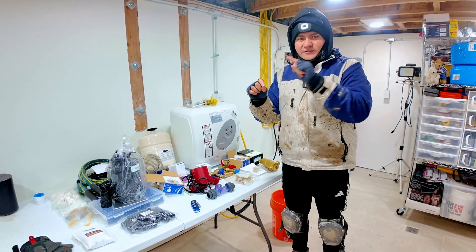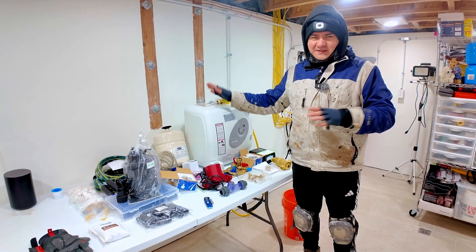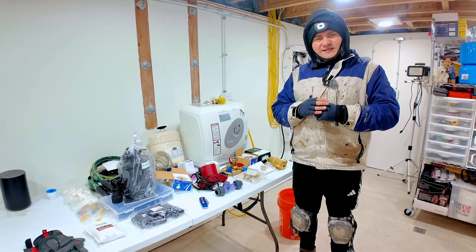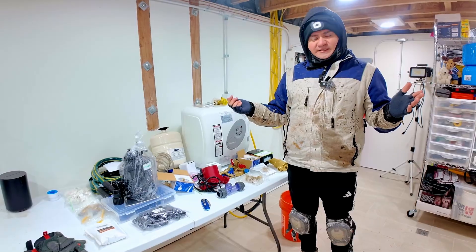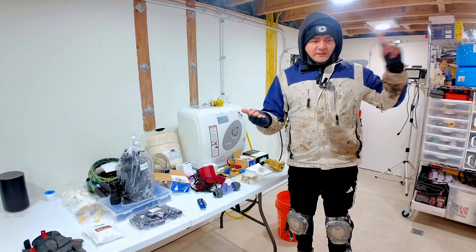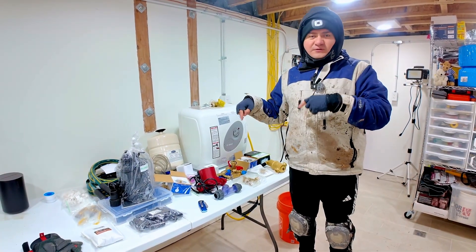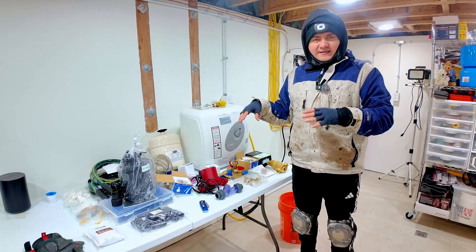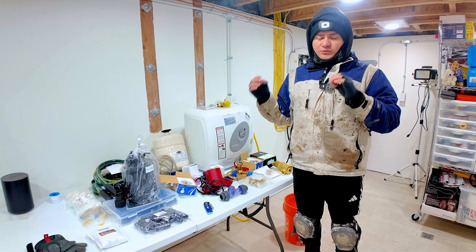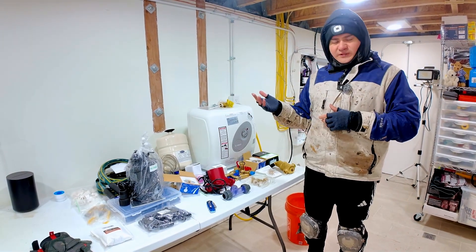I zoomed into the picture, looked at all the different equipment they were using throughout their system, and basically I purchased everything that they chose. My goal is to build it the same way. One very interesting thing I noted from a lot of radiant heat systems is that they use copper when connecting the heater and all that, but once they move on to the circuit under the floor it's actually PEX. I'm going to be doing the system with PEX as well. If you know the reason why they chose to use copper instead of PEX, please comment down below — I would love to know. The reason I don't want to use copper is because copper is really expensive; I think we can do it with PEX.